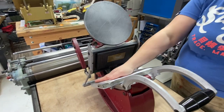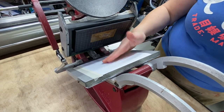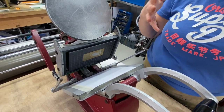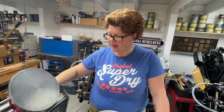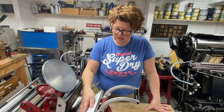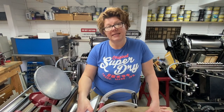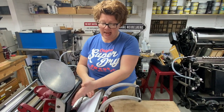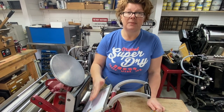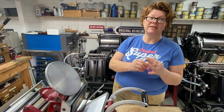You can probably see on here I've got a simple single sheet of tympan or laser copy paper, so that when I mount my male it'll stick to this. On a small tabletop press like this, or even a treadle, it allows us to add packing should we need to go for a deeper impression or deeper emboss. But be careful — adding extra pieces of paper behind here is going to very slightly change the position. And once your male is stuck down onto that paper, if you try to take it off you're going to rip the paper and lose your sticky, so it may be worth having some spare sticky just in case.